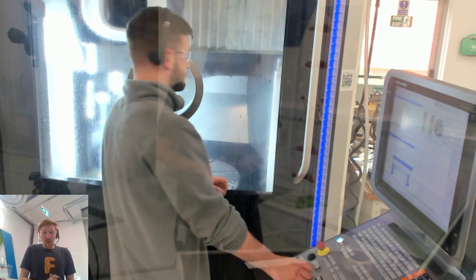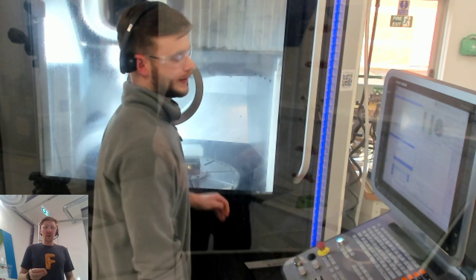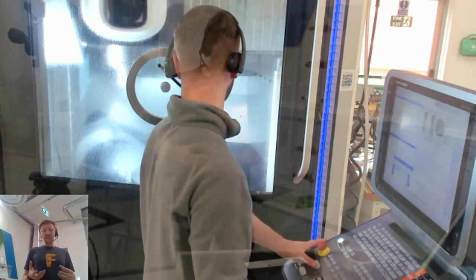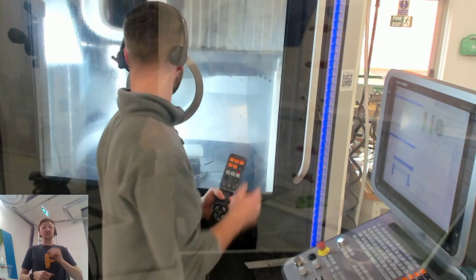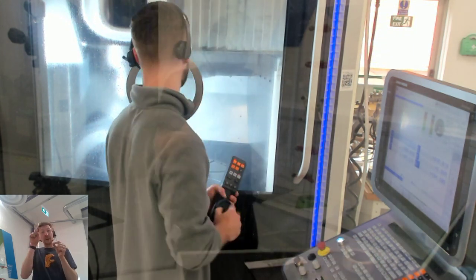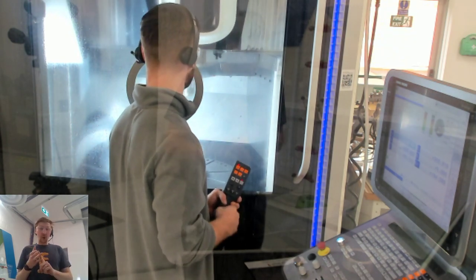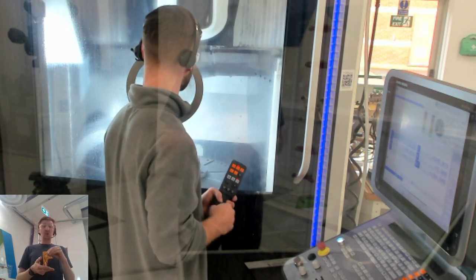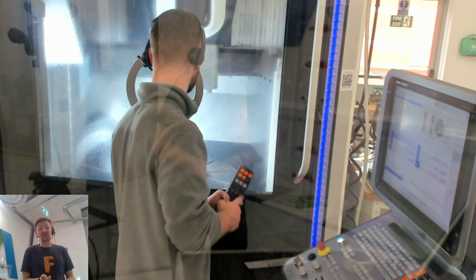So Pavan has asked about anywhere the tool doesn't want to go. What you can do here is a couple of different ways. You can use stock contours to limit where the tool cuts. You could use boundaries to stop where the tool goes. And also there is an extension functionality which you have to pay for, called toolpath trimming, and that allows me to literally select a tiny bit of a toolpath and get rid of it. So you've got two options in base level Fusion, boundaries or stock contours. If those aren't good enough and you need real infinite control, then you can get toolpath trimming. So that's three options for you. If you Google any of those three, you should hopefully see some good videos on them as well.